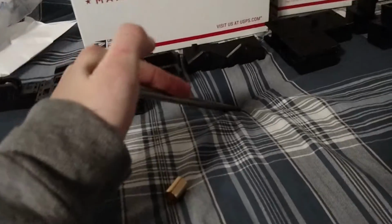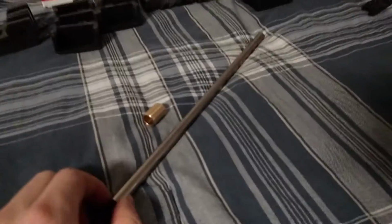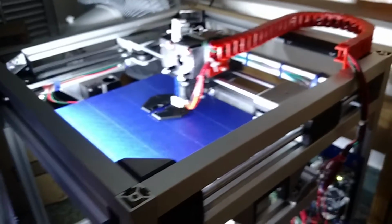Yeah, anyway, these are so much thicker, so much more rigid, a bit heavier, not too much, but that doesn't really matter. Main point is they resist bending a whole lot more, which is awesome, so that when I throw them on here and on here, it won't be so likely to give those slight ripple effects that you may see in prints from the 3-up and most other 3D printers.